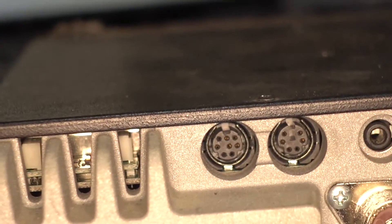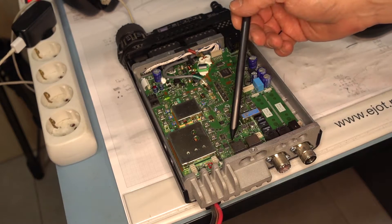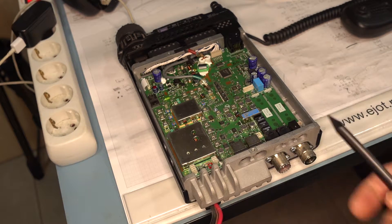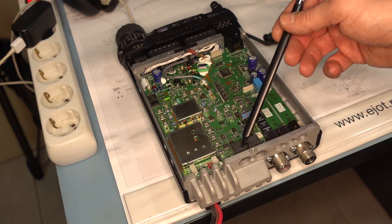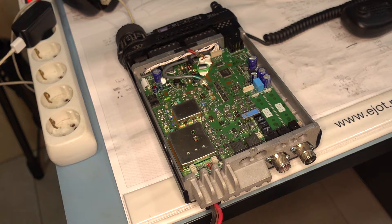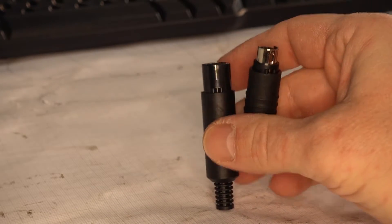This is the CAT connector and this is the pin right there. I want to extract a wire from it. I was trying to solder a wire on the back of this connector to avoid having to split the cables, but that's impossible because the connectors are encapsulated and the components are too small to solder — big risk of destroying the board. So I've bought a male and a female mini DIN 8-pin connector to make a breakout cable.